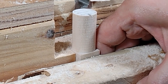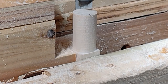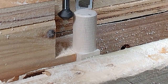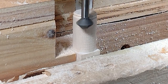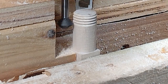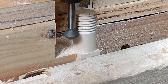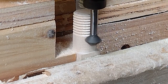Now that I've cut all my blanks into cylinders, it's time to actually start threading them. I actually have two separate toolpaths here combined - the first step will put a chamfer on top of my part, and the next step will actually put the threading around the edge. I'm back to full speed on the video, not sped up, and later once I start doing more of these we'll speed it up. If I was really concerned about production time I'm confident I could speed the machine up quite a bit - it's not taxing the machine at all, it's taking just a little bit off per pass.